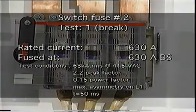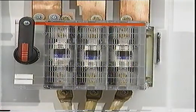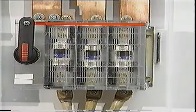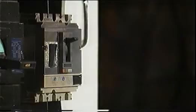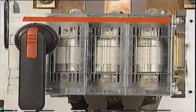The next step was to perform a test on a 630-amp fuse with the same prospective current as the MCCB brake tests. The 630-amp fuse cleared the fault faster than the MCCB and did so without any emissions whatsoever. The 250-amp MCCB is one of the most common sizes used. Often used in multiples on a chassis, this MCCB performed its first trip with substantial emissions and an increase in contact resistance of more than 40%. The same trip test, performed on a 250-amp fuse, produced no emissions at all. Its energy let-through was over 30% less than that of the 250-amp MCCB.